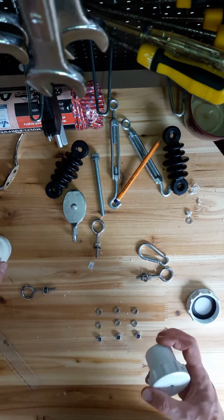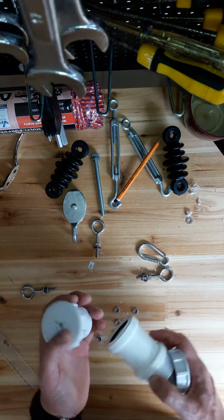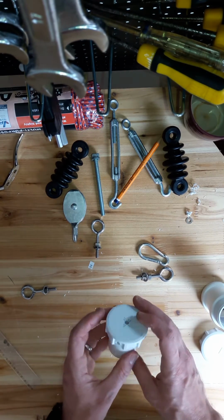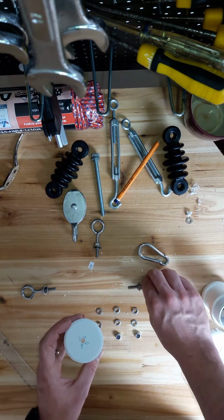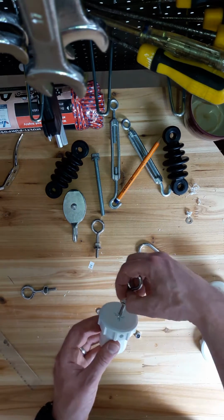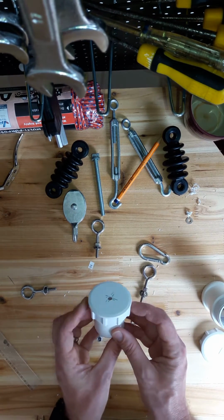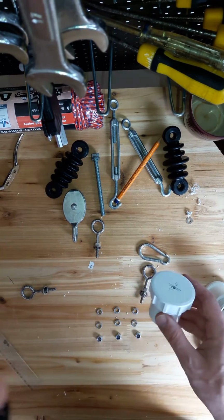So as I said, I'm making the feed point connector, the housing for it, out of wastewater pipe. So I have a drill stand here, and I've already drilled out this element. So these are 8mm holes, and these will take these eye bolts. And as you know from the previous video, one eye bolt is going to be used to suspend the feed point connector for the doublet, and then the 2 other eye bolts either side will be the anchor points for the antenna, the radiating elements for the copper wire.